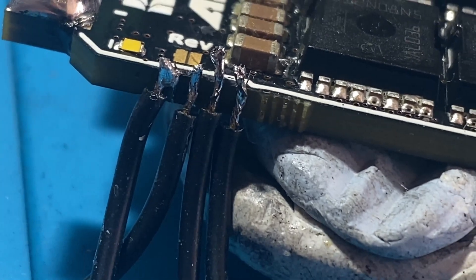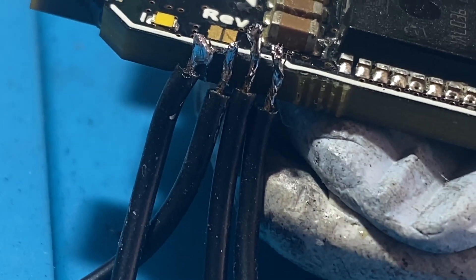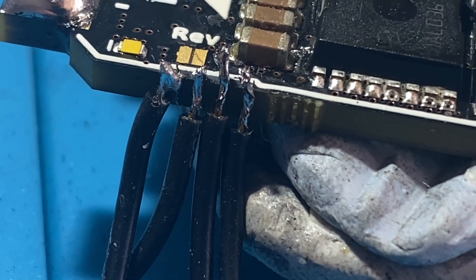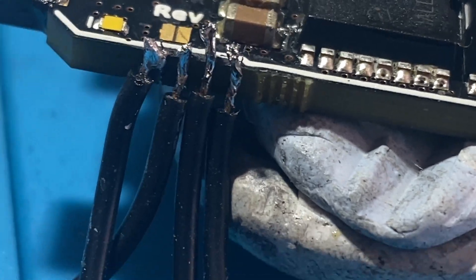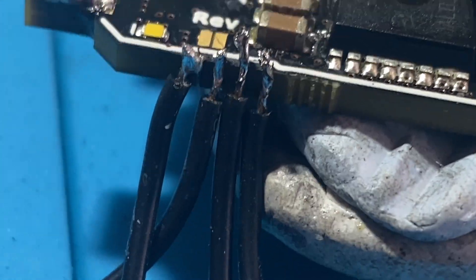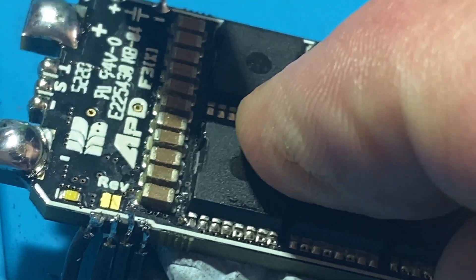If you get the edge of that ESC too hot, it secretes the fluid and then once that's burnt onto the copper, soldering is near impossible. You have been warned. Speed is of the essence here — ground is the worst because it wicks the heat away. Any contact is good, as long as they don't fall off. Stick it on some plaster, keep it secure while you're bridging the boot pins.